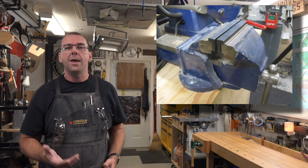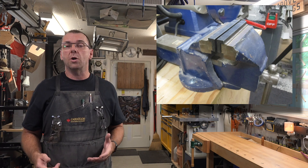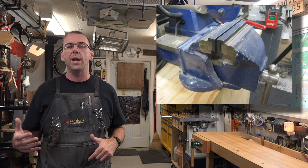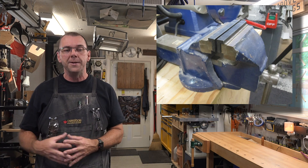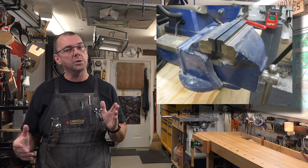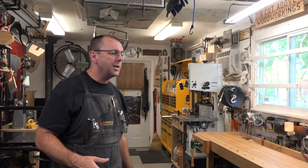There you have it — ABS plastic jaws for your steel bench vice. It's a quick, fun, and practical project. Many shops only have one steel vice and it's frustrating trying to use it for woodworking without marring the piece. These jaws solve that. They're also useful for holding things like bolt threads, though those will eventually mar the plastic. I'll put links below for where to obtain the plastic. Hope you'll join me for another Alternative Tuesday!